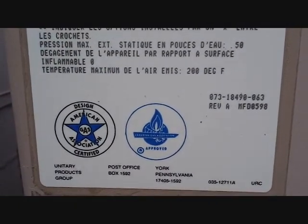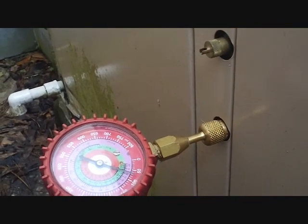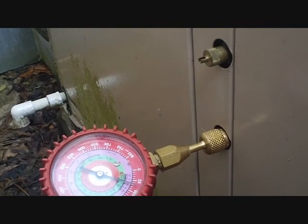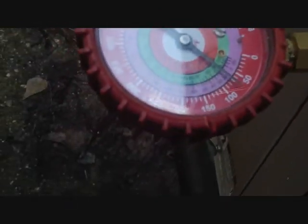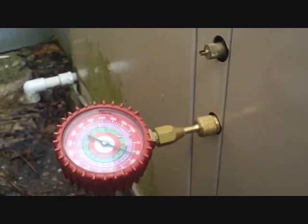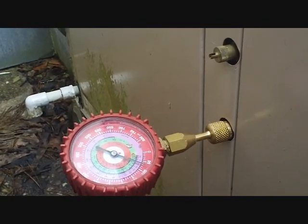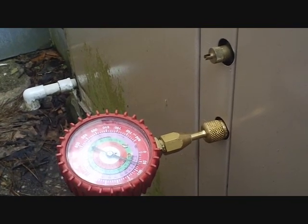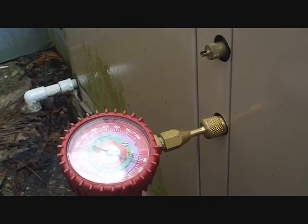I'm going to start it up on cooling because these people have been waiting a couple of days. I actually adjusted the blower down a little bit because the airspeed was too high — the outlets were getting excessive airflow, so I brought it down a notch. I switched the capacitor down a little bit as well; it had too much torque on startup and was putting too much air into the house. I put a gauge on there — it's reading around 70 pounds, just over 70, coming up a little bit. I'd hate to walk off and have them call back about low refrigerant. Even though techs aren't responsible for every future problem, with a 20-year-old machine you want to make a few quick checks to rule out nuisance stuff.